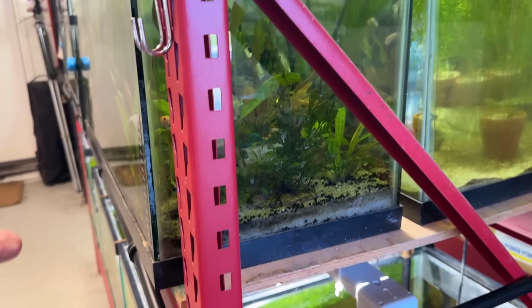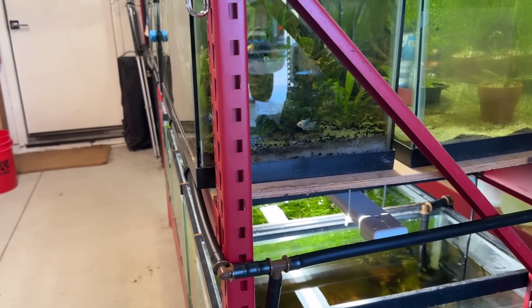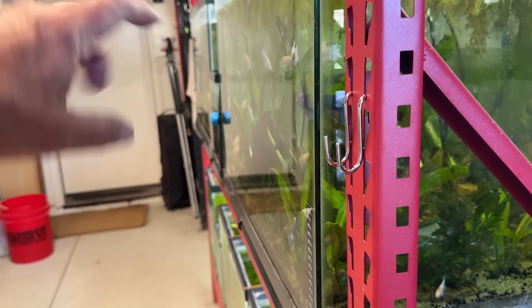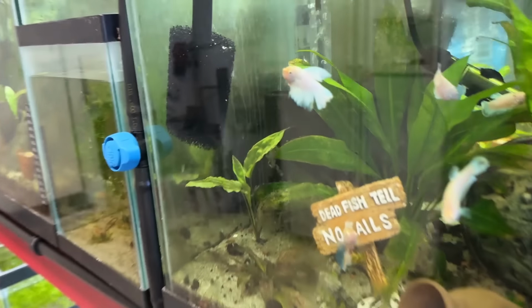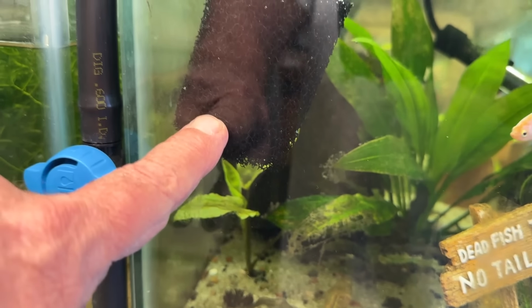And it'll start an automatic siphon. At least that's the theory. Start an automatic siphon, and it'll come out of the hose. Now, when I'm done with said tank, I shut that valve back off, and that keeps the upper part charged. The only way I'm going to break that siphon is if I let this drain all the way to the bottom and it starts sucking air.